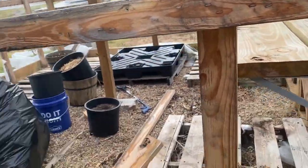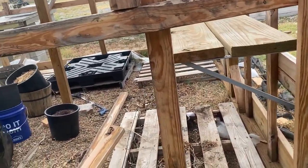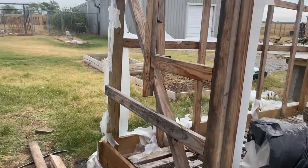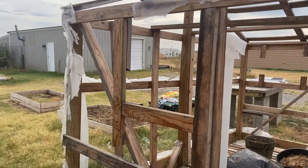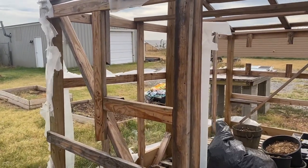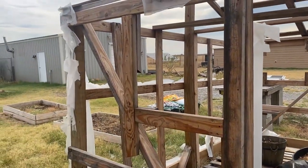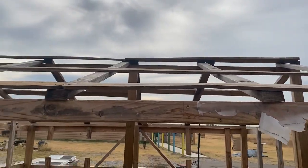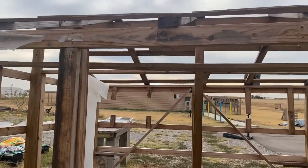On this one I used a basic clear waterproofer and that did not stand the test of time. So on this next upcoming greenhouse I'm gonna use a membrane — like a water membrane, the kind you use when doing tile or a shower pan. I'm gonna get after it with that and see how it does. And I'm actually gonna do a better roofing job since I know how to build basic trusses now.